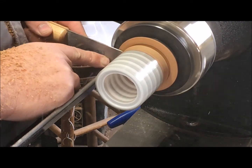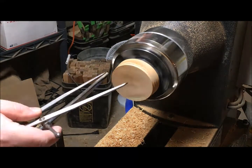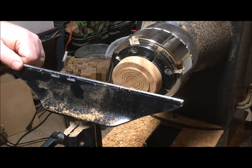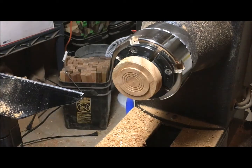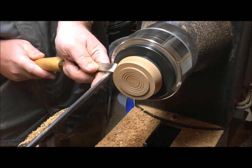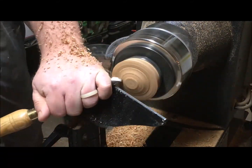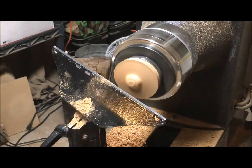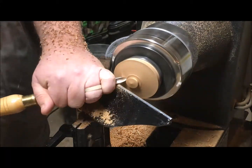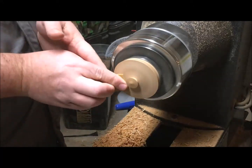With our resin base all polished up, we're ready to just part it off the lathe, and I hand-sanded it when done. Now let's make a lid for it. Just like the base I mounted some mesquite in the chuck, measured with dividers on one end, scored a line, and I'll go down to that line and keep fitting it until it works. I like to make a few lines in the bottom just to give you a surprise as you open up the box. I'll shape it and turn it around in the chuck on that tenon — it's going to leave a few marks but not in a noticeable place — then make a knob or handle on top, define and clean it all up, and we'll be ready to sand and finish. I ended up using walnut oil for the finish and it really brought out the color of the mesquite nicely.